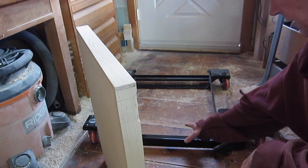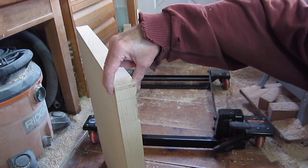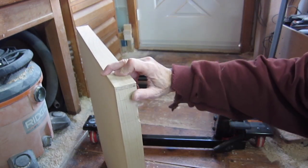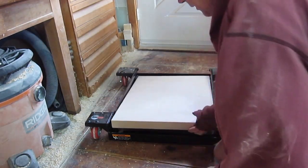The mobile base adds one quarter inch height, so I made another one and three quarter inch riser by gluing together three pieces of plywood. I rounded this with a three eighths inch roundover bit so that it would fit into the curve there, and this fits in there.